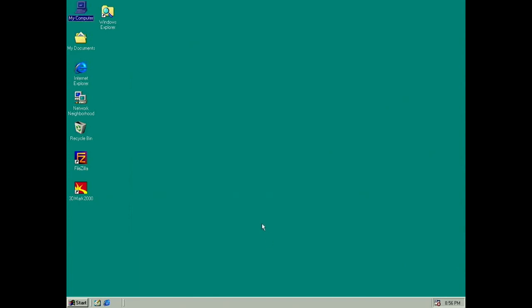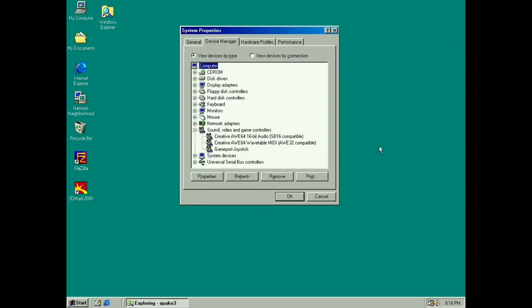Before, when I installed with old caps, I had a blue screen during Windows with the proper voltage for the CPU. I had problems running 3DMark 2000, and that seems to work right now. I wasn't sure the caps would actually fix those problems. I figured it might have been software, but seems like that wasn't the cause. And we obviously have the ceramic caps installed here, so that might have done some good too.